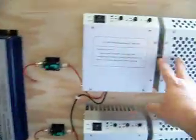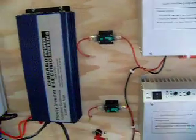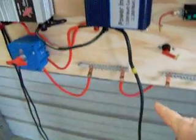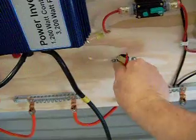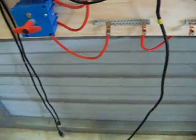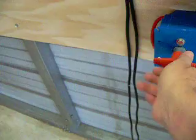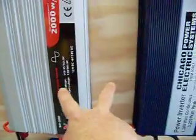The power comes through here and out from this 10-gauge wire, from either inverter. It goes through a 30-amp breaker that you see here, and then from there it will go through this disconnect switch — I still need to label it — and that allows me to isolate the power to the batteries. From the batteries the cables will come up here, and then here's my battery disconnect switch, which will disconnect the power from the batteries to the inverters.